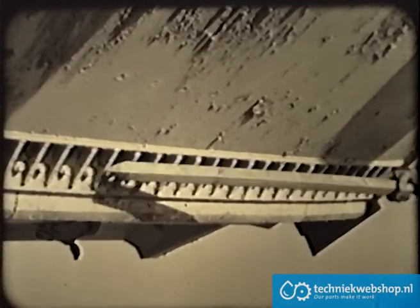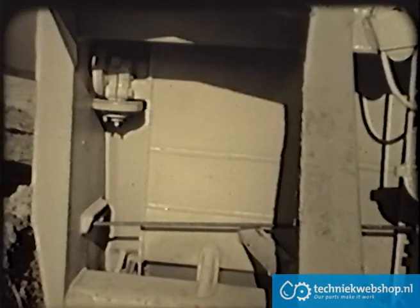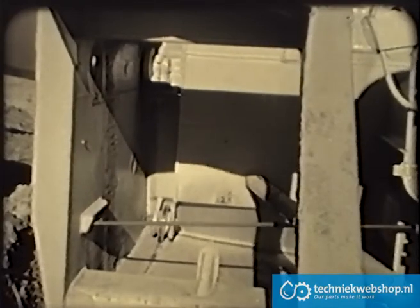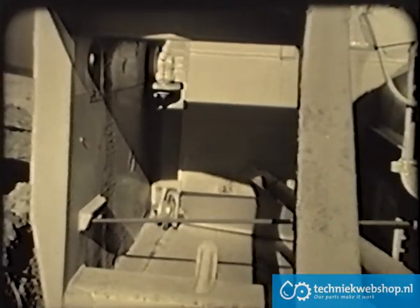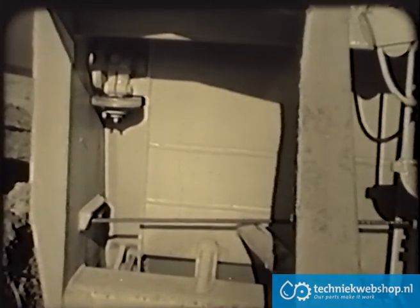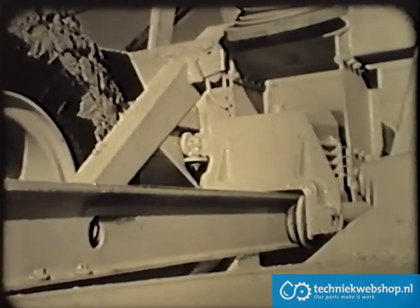Back of the cutting edge, a sturdy reinforcing plate forms part of the bowl. Gussets add to this strength and protect the nuts from damage. The heavily reinforced ejector plate rides on two bottom rollers. Both side and upward thrusts are taken by two additional sets of rollers. Thus, the ejector rides forward and back, cleaning the sides and bottom of the bowl. The rollers at the back end of the pusher help maintain alignment of the ejector assembly. As the cable is taken up, the ejector pushes ahead without binding.